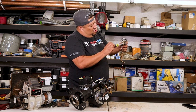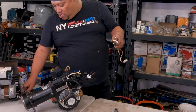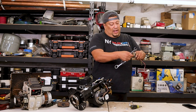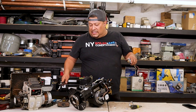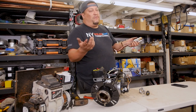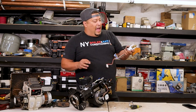You want to get access to the nozzle. If you ever have to replace a nozzle, it's very easy — take a flat screwdriver, loosen her up, and that's it. To take off the nozzle, you need a three-quarter and five-eighth box wrench — go like this and that's it, you remove the nozzle. The nozzles look exactly the same but they're not. You always have to read the number stamped on the nozzle because they're each different. This one has a .75, 60 degree — so it's burning three-quarters of a gallon an hour at 60 degrees.